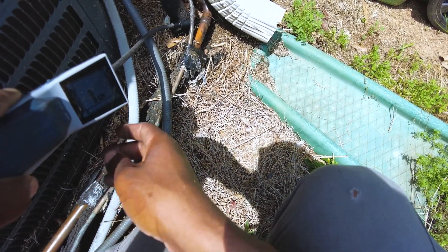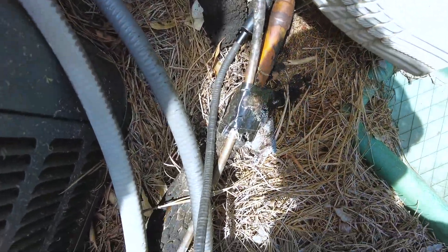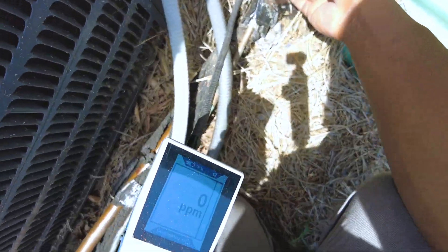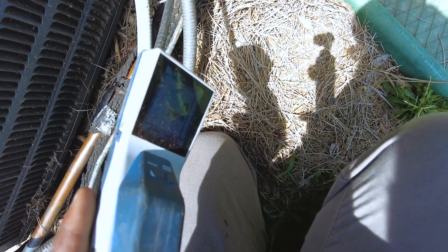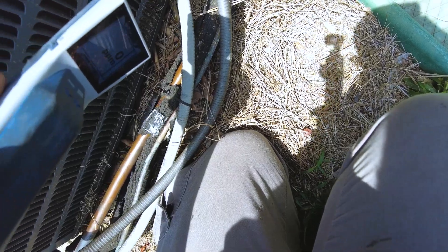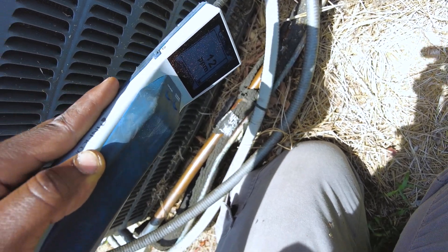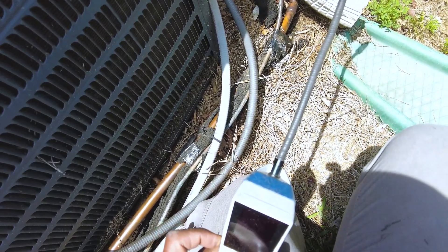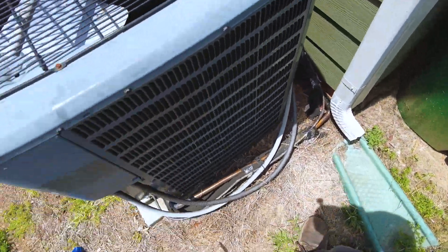Look at that. You have to turn the system off so it'll build up some pressure — when there's a leak in a suction line like this. You can see the oil; it still took me a good while to find it just because it wasn't registering with my leak detector. But once I turned the unit off, let it stabilize, let the low side get a little higher pressure, it started going off. It's a very particular leak. I find that with a mirror inspection mirror — see if we can get that thing going and we'll see.